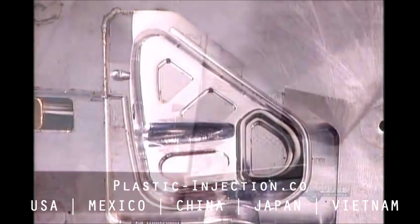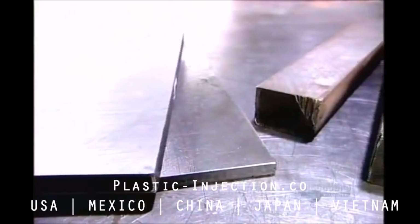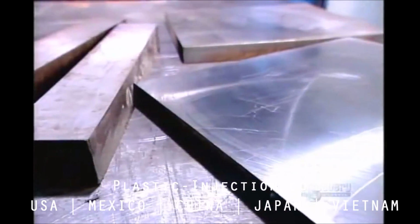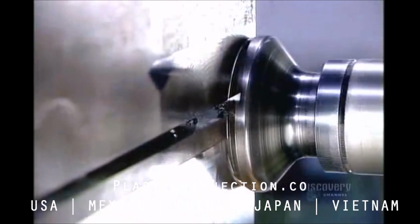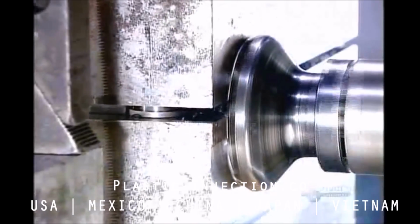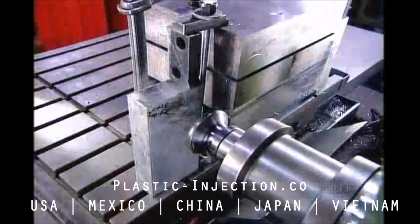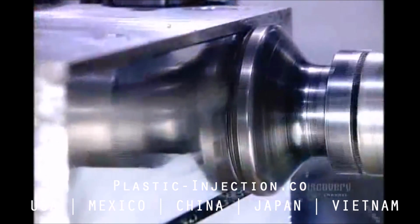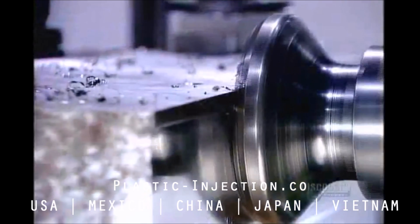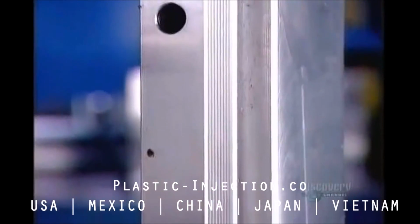The mold begins as bars of chromium steel. Workers assemble several bars into a block called a mold base. They mount this base on a milling machine, which shaves the bars to the right dimension, enabling them to later machine the base into a mold that's faithful to the technical design. A mold usually consists of 2 halves, each of which is comprised of several components.